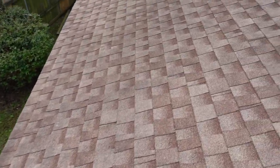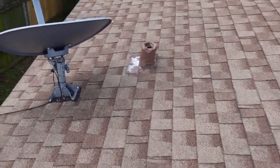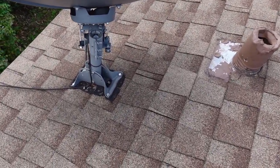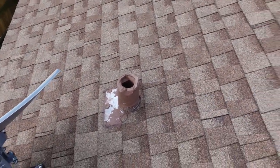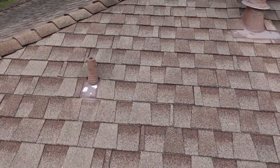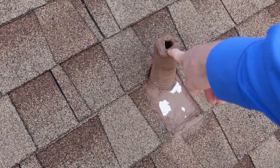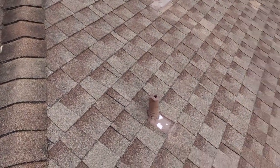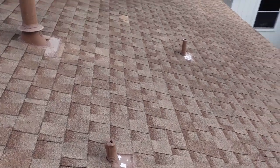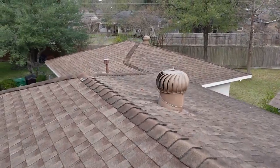Pay attention to the satellite dishes — it's sealed up pretty good, so that should be okay. The lead jacks are turning over and in, which is nice. You can see how this lead jack is turning over and in, and they also caulked the top. The reason they do that is to help prevent squirrels from eating up the lead jacks, because that happens all the time out here. That's really nice.